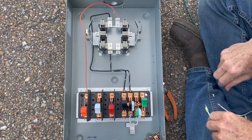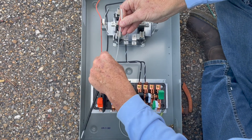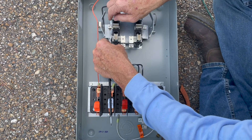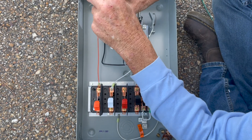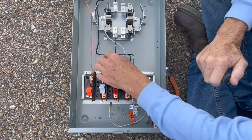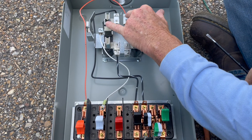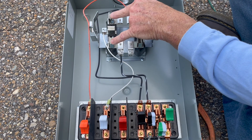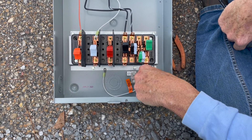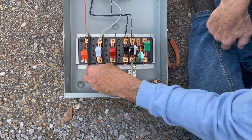The only thing I'm lacking is two more wires. I need a common or ground wire to go to this lug, because this is the other side of the potential coil, which is the ground. Now I have this part wired correctly: one potential coil, 120 volts to ground, and a current in and current out. The only thing I have to change on the bottom of the test switch is to remove this jumper, because I don't need that other current. But I do need this one out current and I need to put a ground here.